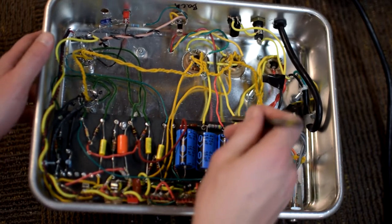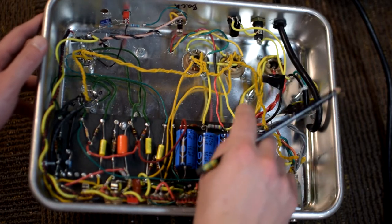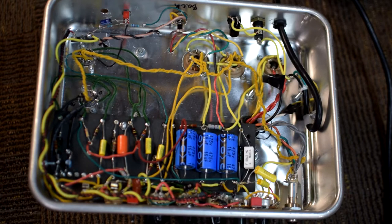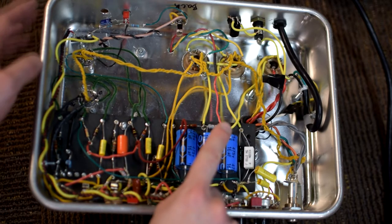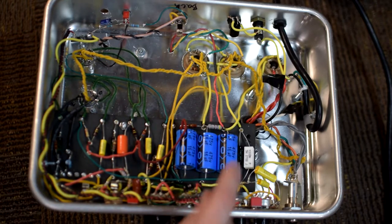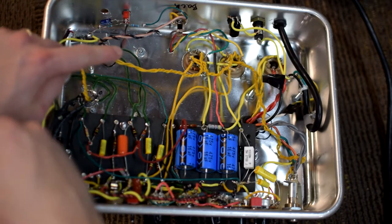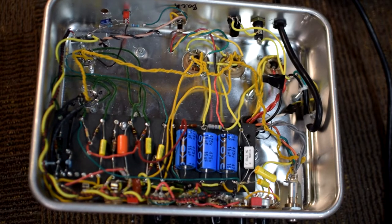And let's say I'm poking around here and my finger comes into contact, we said this is my high voltage line right here, with this leg of the capacitor. Now what I've effectively done, recall from our discussion from earlier, right? I've given the electricity a path to go into my finger, travel up through my right arm, travel through my chest, and now it is going to come out my left arm into the chassis, and that is giving it a source and a path to ground, right?